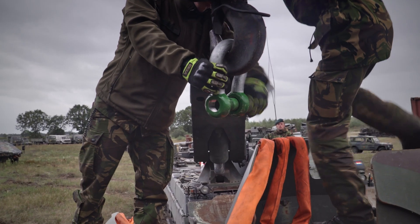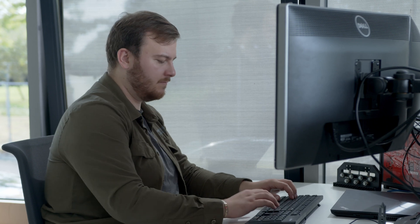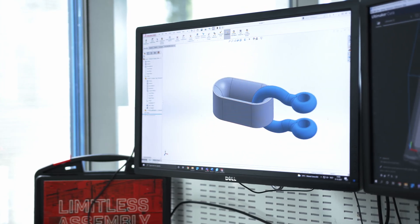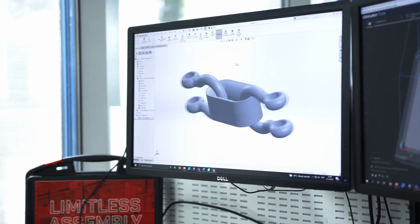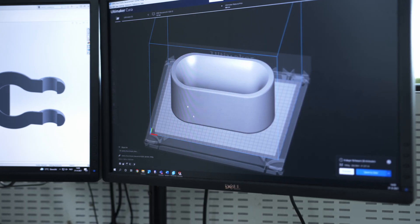The first step was to map all the specifications and requirements for this project and create a design engineered to withstand such extreme forces. We need to know what we're actually going to lift and what our connected link would be attached to. After knowing this, we had to look at the design of the link itself and the rest of the link construction. This primarily meant getting the forces on the interactive surfaces of the link to spread out as good as possible, so no pressure points could be created.